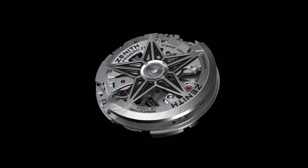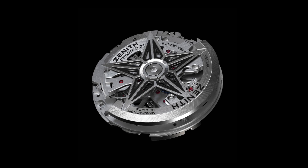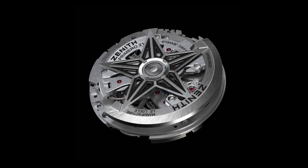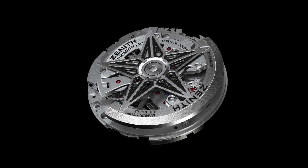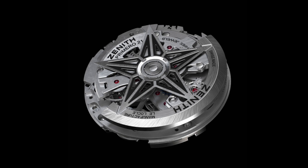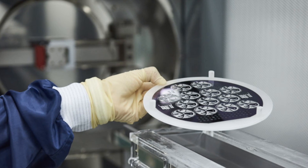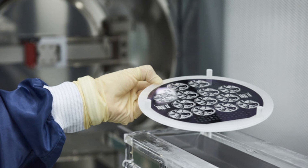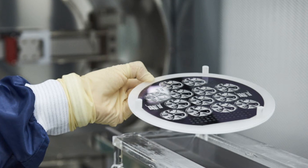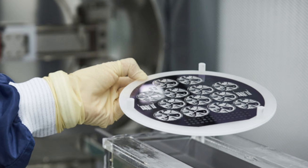As a result of these shortcomings of the traditional design, Guy Simon, who's the general director at TAG Heuer and has been known to work on all of TAG's most innovative projects, has come up with the idea of producing an amalgamation of the balance wheel, the balance spring and the escapement into a single component which can replace all of these parts, and crucially all the bearings that hold these together and reduce accuracy. This is effectively made out of a pancake of wafer-thin silicon engraved and cut extremely precisely to fulfil all the purposes of an escapement and balance wheel, whilst adding accuracy as a single component.